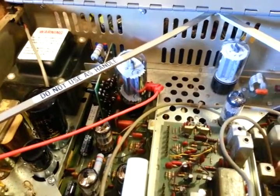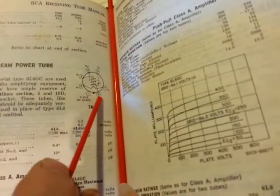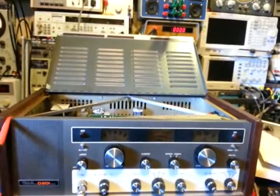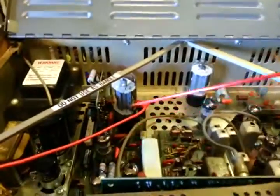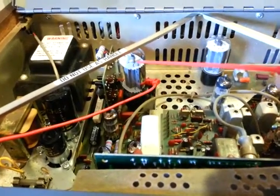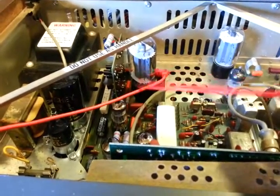Your receive audio disappears too. Looking in the RCA receiving tube manual, pin 8 is the cathode — that's where excessive voltage causes the problem. Just a quick tip: mainly to show that if you ever have that problem, that's what to look for. For a safe startup procedure, install the test lead — just in case there's a problem somewhere else in the audio circuit causing that — and monitor that voltage. The last thing you want is to burn up a brand new 6L6; they're not cheap, especially good vintage tubes. Always hook up a voltmeter to monitor your cathode voltage.